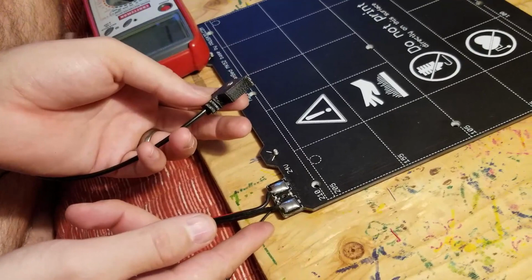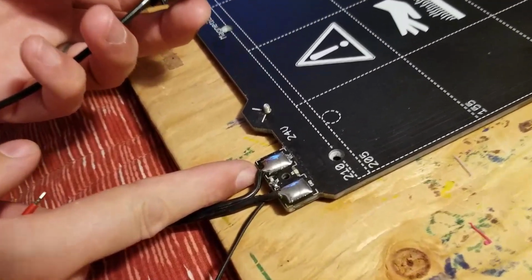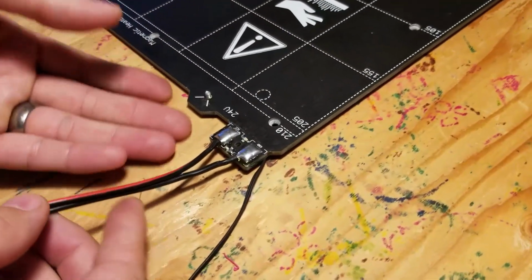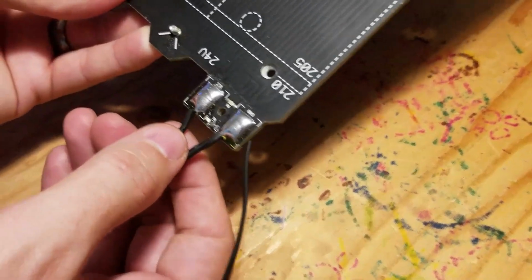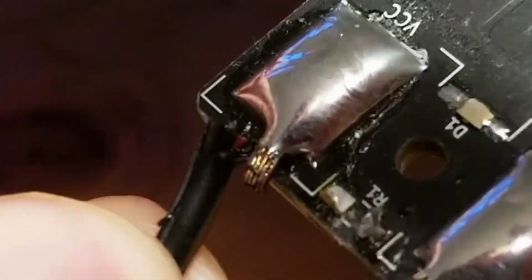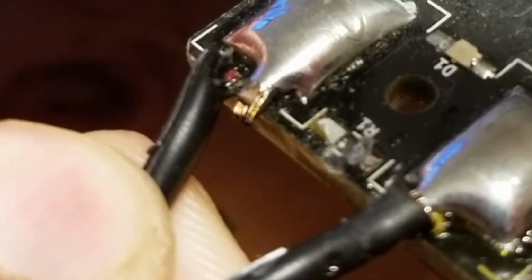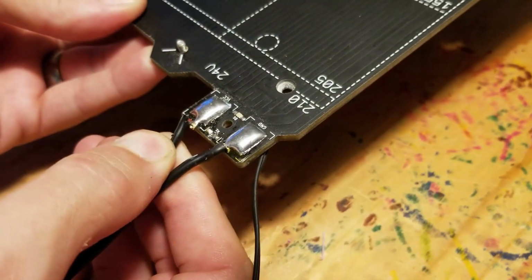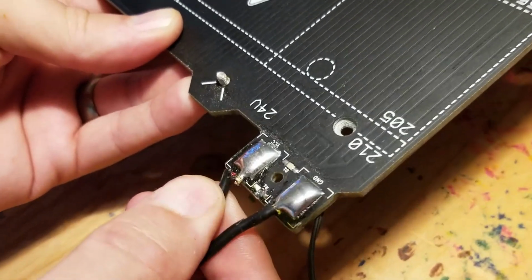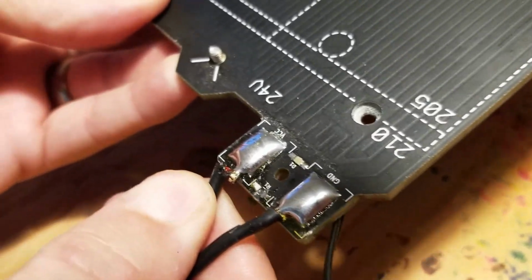So there's your answer. That's why I got this overheat, because just over time the connection got a little loose, because this is a moving part. Okay, as I was starting to pull this apart, I found it. As I move this, look at that. That has broken off. That is the part that just over time wiggled loose and tore itself off. That is the exact reason there. Over time it just wore off and basically the wire just broke clean off.